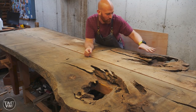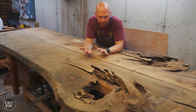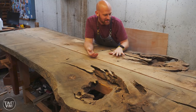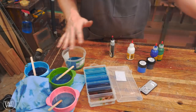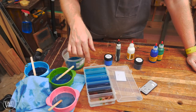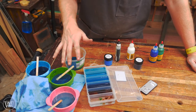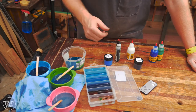As you can see, there are two very large voids in these slabs. My guess is around three gallons of epoxy to fill those. My wife and I are thinking beach glass in the bottom with clear epoxy so you can see down through it — one of the nice things about clear epoxy is you can actually see all the coolness of the wood grain and the bug holes inside. So I'm really wanting to bring out the wood and not show the epoxy — using clear, or maybe slightly tinted. I'm playing with a couple different mixtures, different colors, metallics, dyes, and additives, and laying them out in a testing tray so I can see what each one looks like once they cure. I just finished these so they're still wet — I'll give them about 24 hours and then come back to see them. I'm thinking clear with possibly some tinting or metallics on top, but I haven't quite figured that out yet.